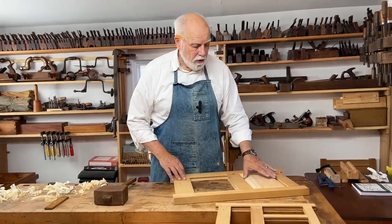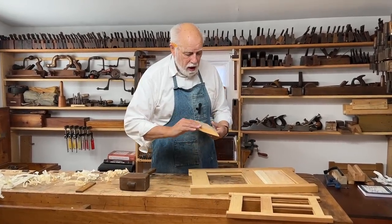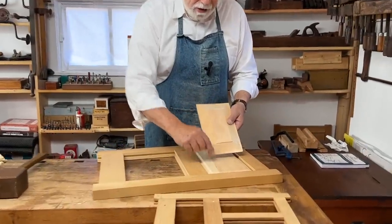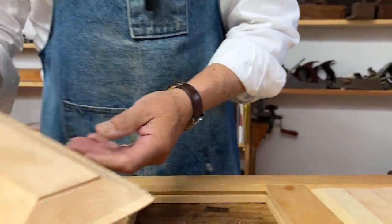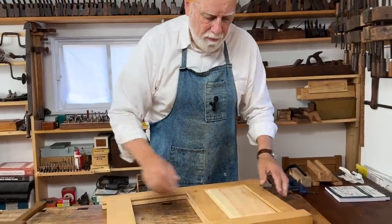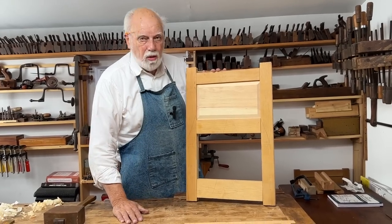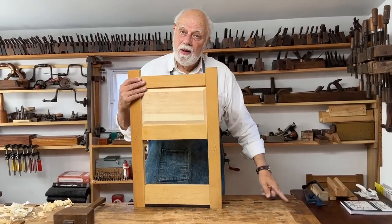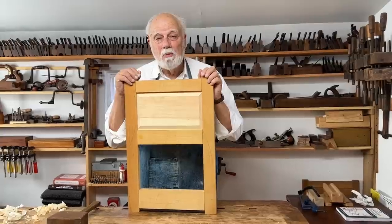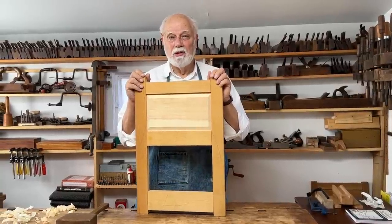This was just the simplest way of fielding a panel so that it will fit into the grooves. But if I had taken a little longer or used a slightly different plane, I could actually have made the field raised by making a little rabbet all the way around the top there. Either way, this is the basic procedure for fitting a panel into what might very well be a nice panel door. I hope you liked that — if you want to see more complicated versions, don't forget to hit the subscribe button and come back and we'll show you more about how wonderful it is to use traditional woodworking hand tools. Thank you.